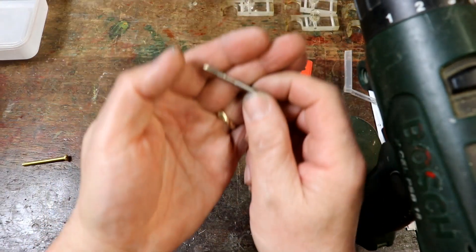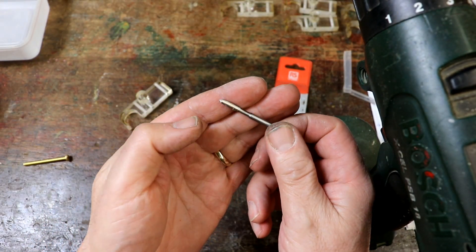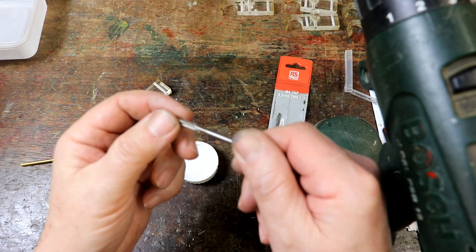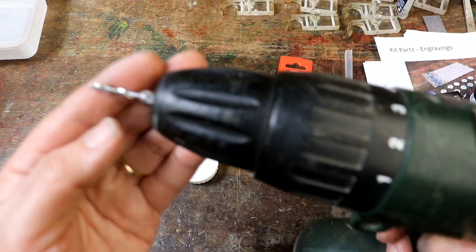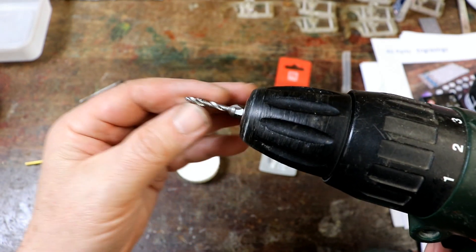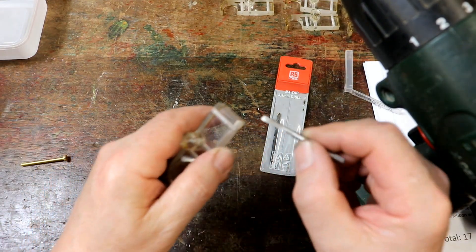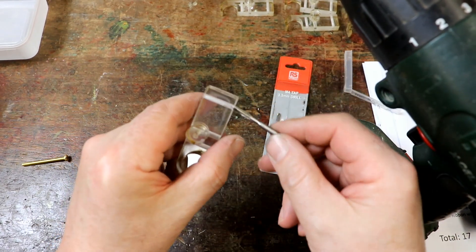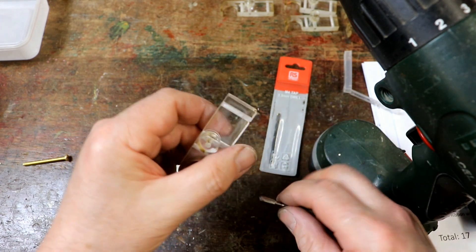I can't tell you how exciting this is, because there's the tap - that's the sort of tap I've used previously. Drill the hole a bit smaller than the thread size, and then use an M4 tap to cut the thread. You have to go in, back, in, back, clearing the swarf as you go. I suddenly thought, having talked about this one part drill-and-tap, whether that would help. Because the problem is, when you tap a hole, especially in something soft like plastic, it's very easy to get it slightly not perpendicular, and the plastic is very forgiving and then you just end up with it ruined.